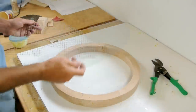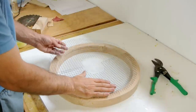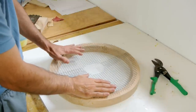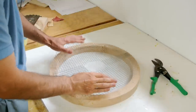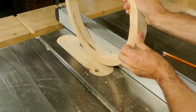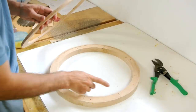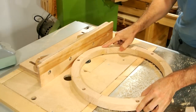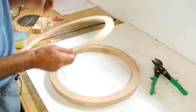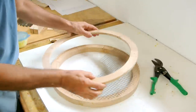To keep Max's fingers out of the soil in the flower pot, I made this metal hardware cloth screen. That has to be in two parts so we can get it around the tree. To attach this, I actually cut the ring in halves, and after I cut it in half I milled this groove around here with a router so that the screen can fit behind this groove when the top is attached.